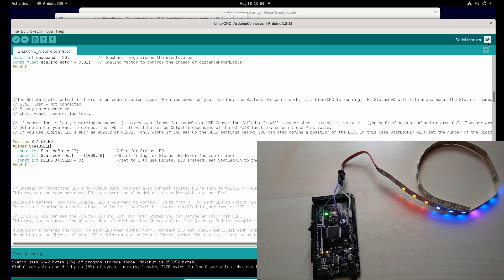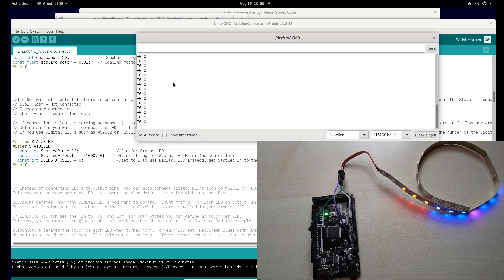That is actually why the Arduino sends the E command all the time — to detect if there is a connection. When I answer, you can see it gets the information and just stays on. When the script is running, it will send the E command again and again in a certain time frame, so the Arduino knows the connection is established. If the Arduino hasn't heard from the script for some time, it starts to blink again.